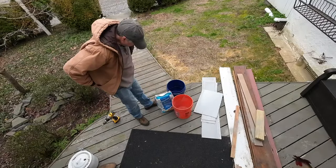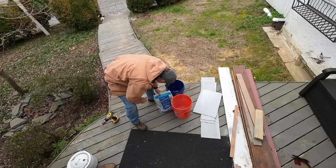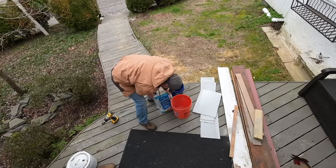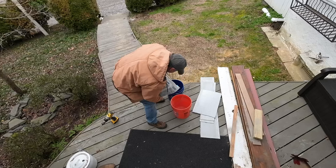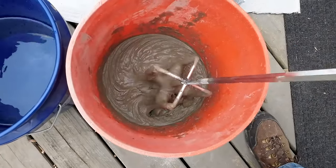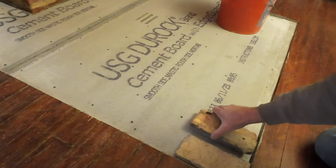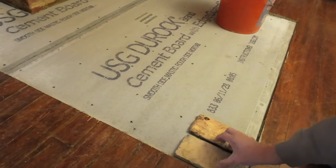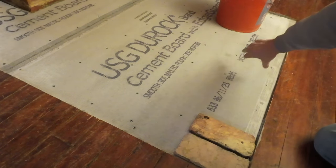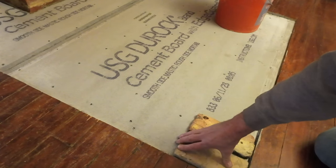This should go really quickly and we will be ready to set the brick in place and grout it hopefully tomorrow. This is Ultraflex tile mortar — it's gray and it's the modified type. That looks like a nice consistency. If you took part in the Facebook poll I put up, I've decided to go with design number two, which is two bricks vertical, two bricks horizontal — vertical, horizontal. I don't know what that pattern's called, but it matches the sidewalk pattern we have here.